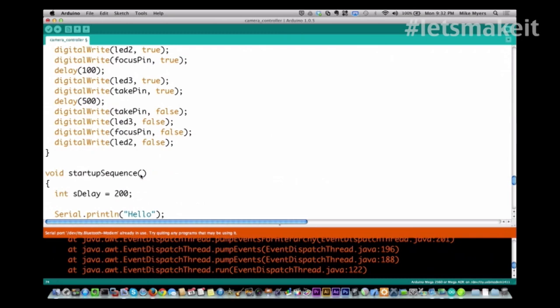And so if you had a camera that had a really long exposure time, you could change that value. Absolutely, and everything would work still. Most cameras will do it for you automatically now, but if you have an older style camera, it will hold it open as long as you need to. I didn't make any adjustments for shutter time because the camera I was going to use does it automatically. You tell it when to take it, and it does everything else from that point on for you. But with the older cameras, you're right, you need to hold a shutter open longer, so you have to adjust your shutter time. So you could add another variable to this to adjust for that.